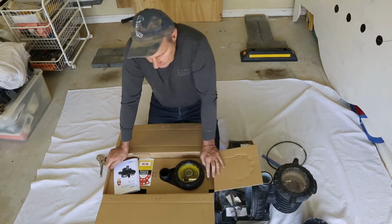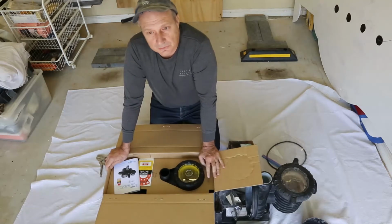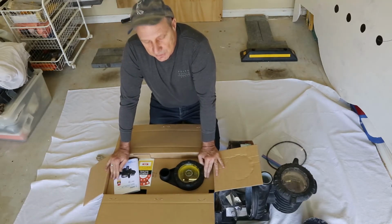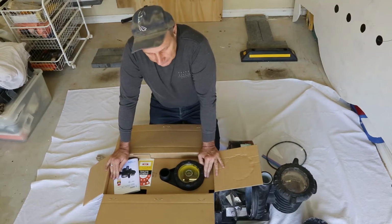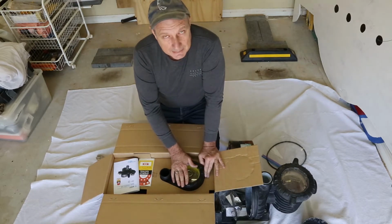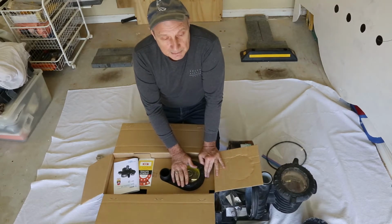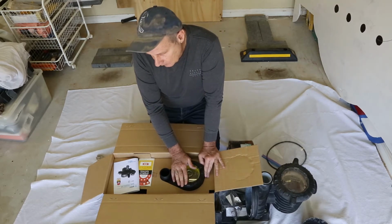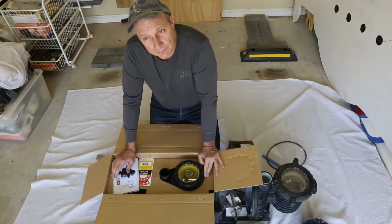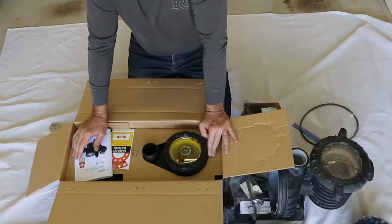Now, I guess the thinking about variable speed is once you reduce your power, reduce the speed of the pump, you do reduce your water flow. Now, there are some gains in technology over the years with maybe a better design of the pump, and you move more water for less power. That sort of calculation can go on as well. But generally speaking, you reduce your power, reduce the speed of the motor, reduce your water. You reduce the suction as well, which is the killer.